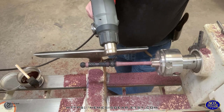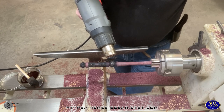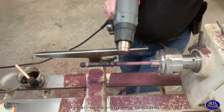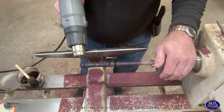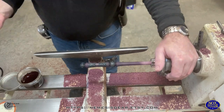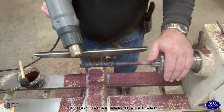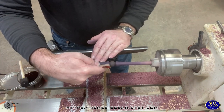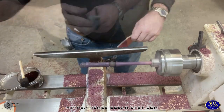As you can see, it's starting to darken that purple up, and where it's ebonized it's going to be almost black. You can sand part of this back out — the ebonizing fluid only goes so deep into the wood, so you can kind of sand some of that back out and bring some of the color back if you get it too dark. I don't know if you can do that if you put it in the oven, because the oven heats it more evenly throughout, and I don't know if it has to do with heat solely or heat and oxidation both. I just find it's a lot easier to use a heat gun or a torch rather than putting it in the oven to bring that color back out.